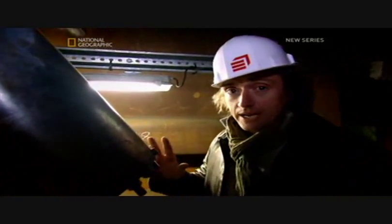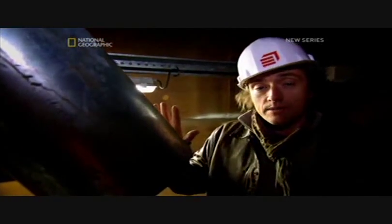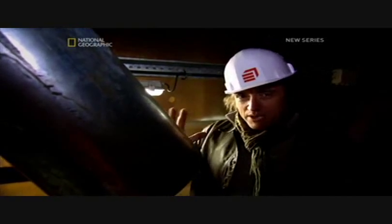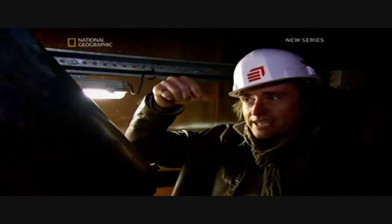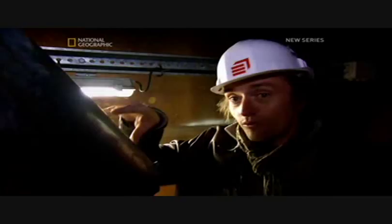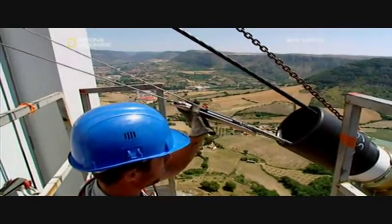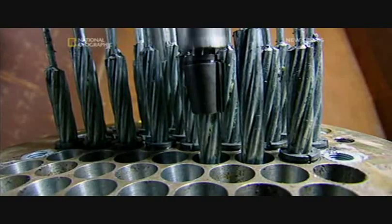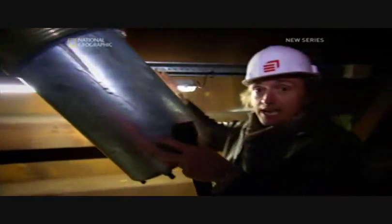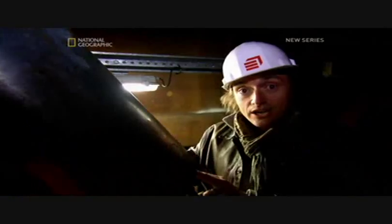A triumph for Wilhelm Albert's metal rope idea. But there's a neat twist at Millau — the bridge is designed to last 120 years, and inevitably a century-old cable isn't as strong as a new one. If the bridge is held up by cables, how do you replace them without it falling down? The answer lies in the construction of the cables themselves. Although they look like a single solid piece, each one is made up of a bundle of as many as 91 smaller cables, each of which is made up of seven individual strands. Each of those mid-sized cables can be taken down and replaced if they corrode, without having to take down the entire bundle.